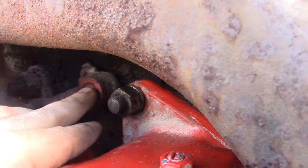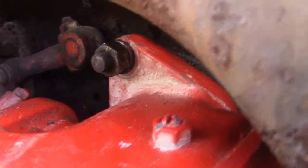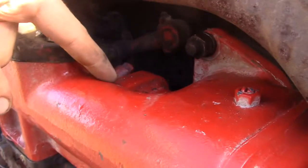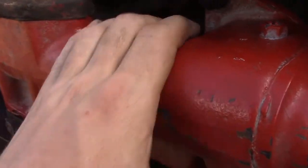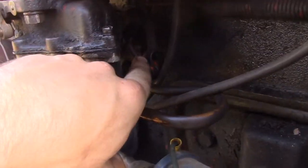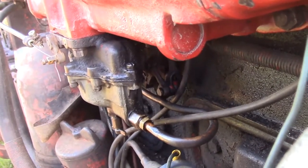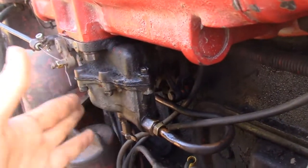This is a cross shaft that goes through the head. When you kick it to either gas or diesel it goes through here and you have a little linkage that moves up and down. On the back side of this manifold there is a fork that moves up and down, and when it does that there is a butterfly that opens and closes inside this manifold. Also, when you change back and forth between gas and diesel, another linkage opens and closes your needle in the seat in your carburetor. On the diesel side that needle is locked into its seat so gas cannot flow into the carburetor; on the gas side it is left open so gas can flow freely.